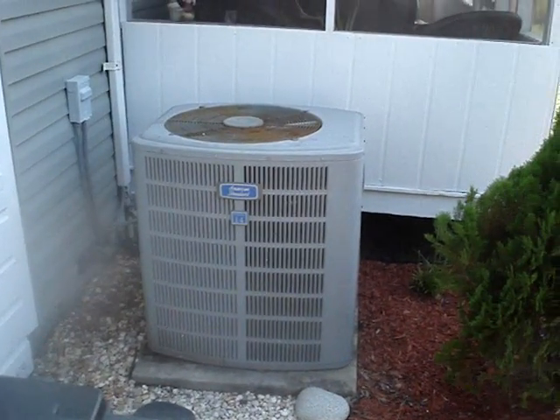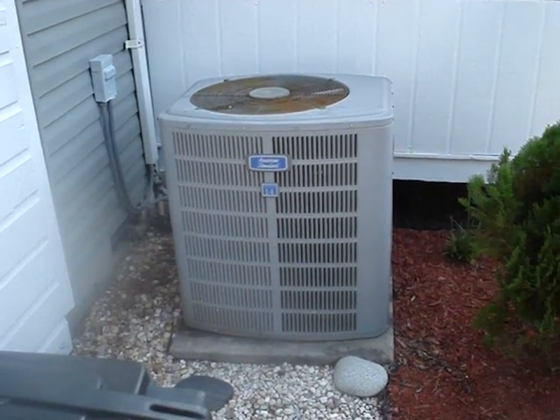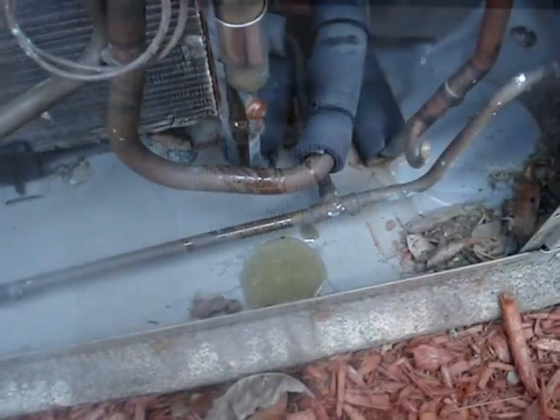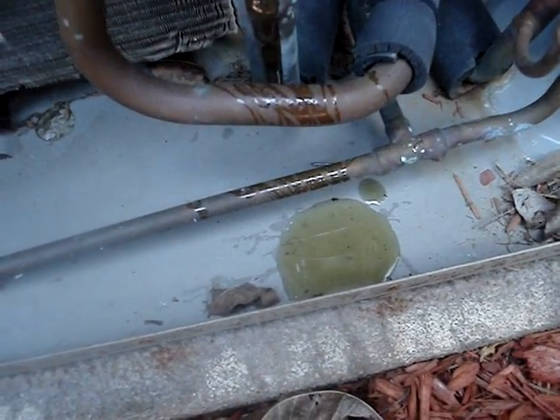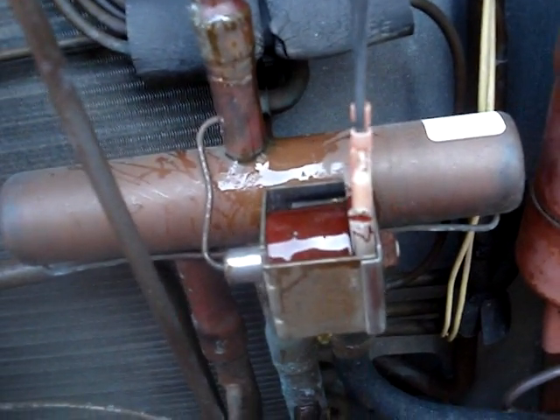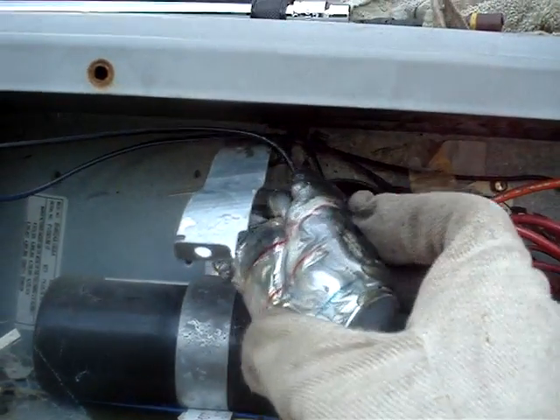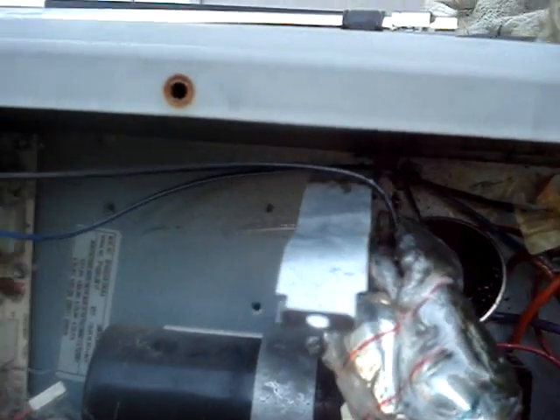This is our unit for today. A complaint heard a popping sound, so we're going to see if that popping sound was a capacitor explosion. There's some stuff right there on the reversing valve, going all the way up — I'm thinking that trail is going to lead to a capacitor with its guts on the outside. Look at that.